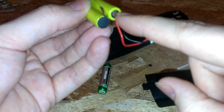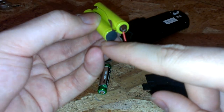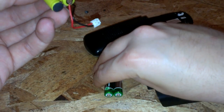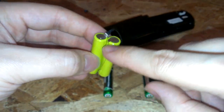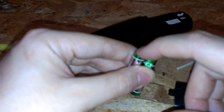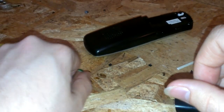That would be your negative, that would be your positive. They've got both of them like this — positive to positive, so the positive goes back and the negative goes here, then over to positive again. I'm going to put them like this, solder this to that, and I'd have my positive and negative — that'd be 2.4 volts, since these are 1.2 volts each.